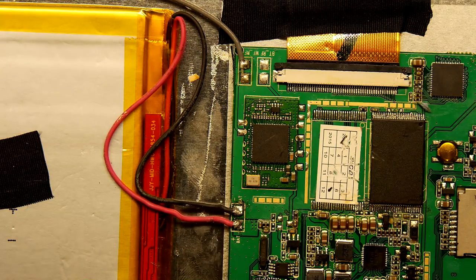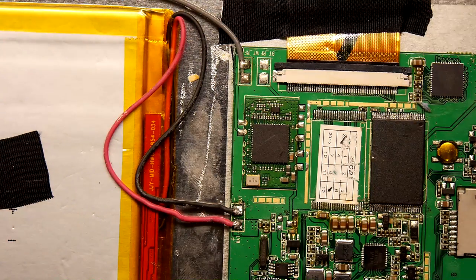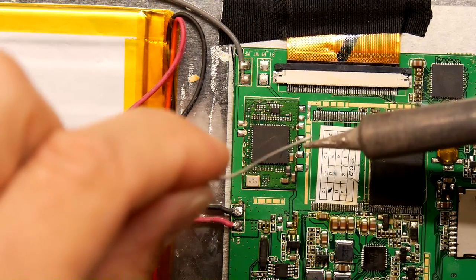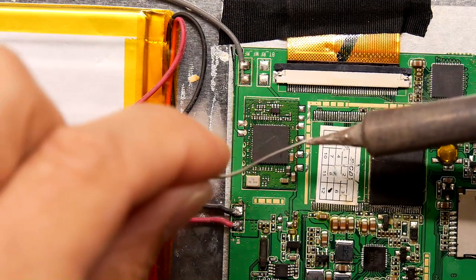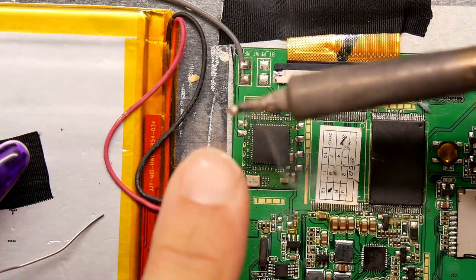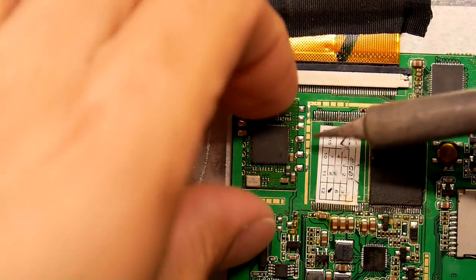You could buy this in quantity, so I thought we'll save this — it's a useful thing. So I've got my soldering iron on, I'll just clean the tip. Here's another hot tip for you, excuse the pun: when you turn your soldering iron off, leave a blob of solder on the end and then turn it off, because that blob of solder will sort of protect the tip and it'll be good to go next time.